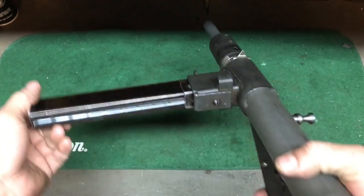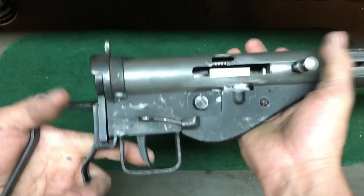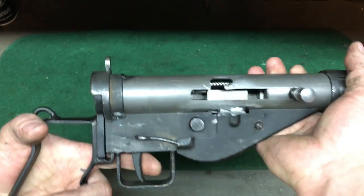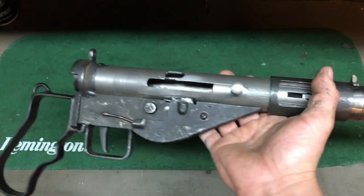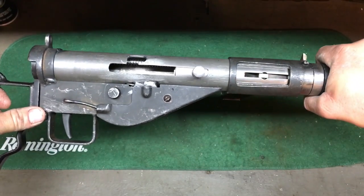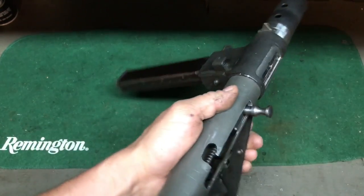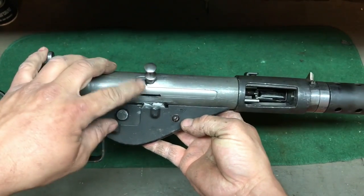The magazine and ejector everything's got to line up with the bolt, and it does with this magazine. The trigger on this thing is pretty heavy — I'd say eight or nine pounds — but you can also play with the springs on it. Milling-wise, I just used a Dremel, a lot of hand files, and a drill. I got them pretty good; I just need to shape this a little bit more.